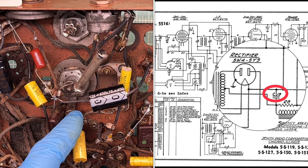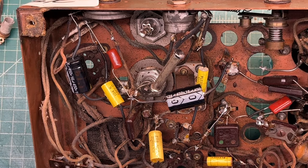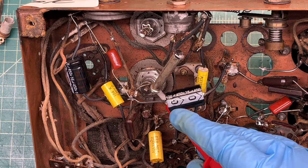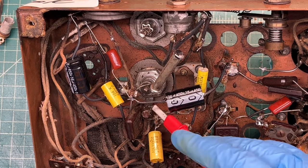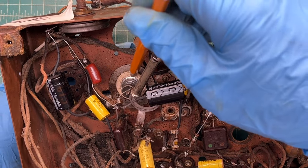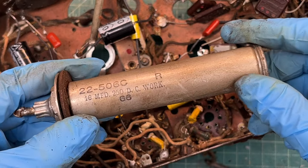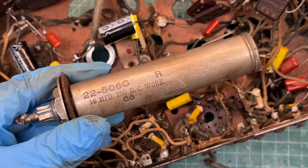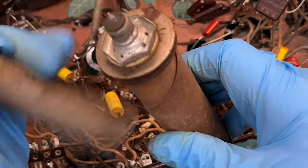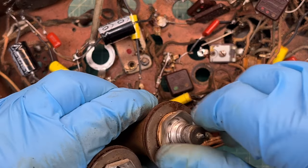This connection should be floating, not back to chassis ground. Let me just check for continuity on my meter — and it is floating indeed. So I'm going to go ahead and remove this and leave this in place as a mental reminder. You can see the insulating material here, so this one is floating free from chassis ground. What I believe to be the two original e-caps removed: 22506C — 16 microfarads at 250 volts — and then this one just wrapped in cardboard with no markings, again floating free from the chassis.